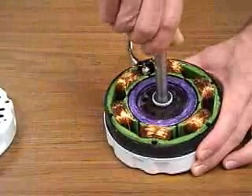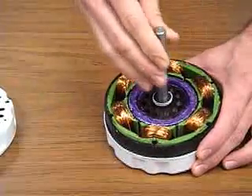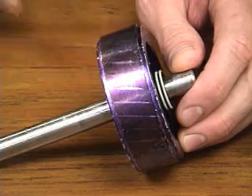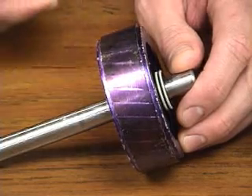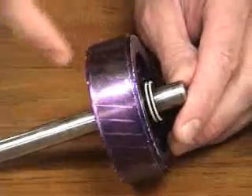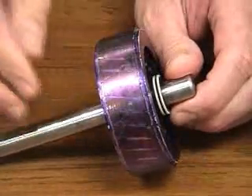As you can see, the rotor assembly rotates around the stator coils. The rotor in an induction motor is the classic squirrel cage design. The squirrel cage is embedded into the core, which makes it difficult to see the actual squirrel cage. Taking a closer look at these lines going across, those are the individual bars of the squirrel cage.